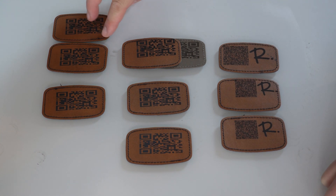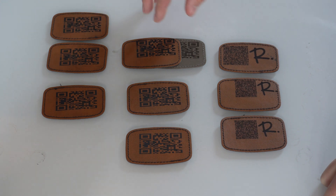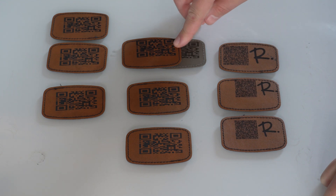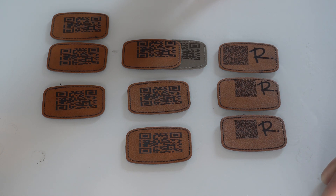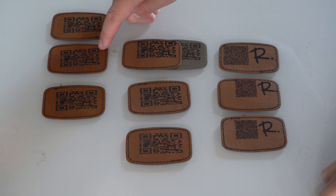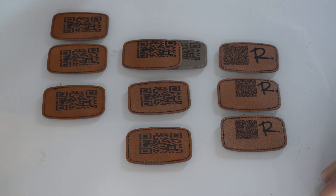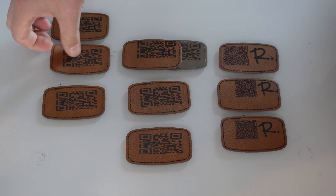I like 5,000 millimeters a second with 20% or 25% max power — it has really good detail and color. If you go down to 4,000 millimeters a second, 20% might be okay, maybe a tad too much — I would probably go down to 15%. But I don't see the point in going down to 4,000 when the results are fine at 5,000 and it saves time. For most prints I would go with 5,000 millimeters a second at 20% max power, assuming you're using a 10 watt laser. If you're using a different wattage, you'll want to do some more tests.